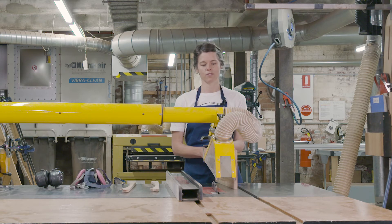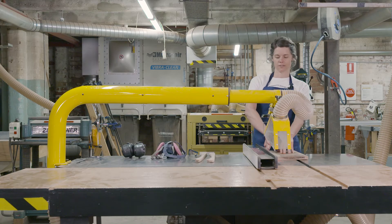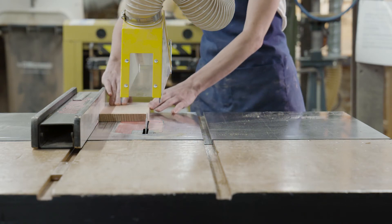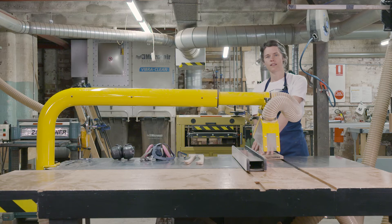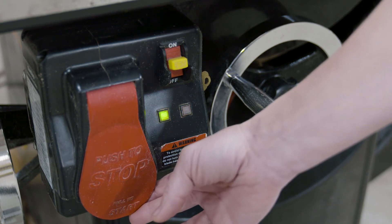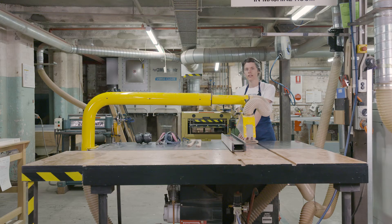Consult your tutor if you're going to make a deep cut. Now that we've covered the setup for making your rip cut, I'll walk you through the motions of making the cut itself. You'll want the face of the board sitting flat against the fence and flat against the table. Remember to stand to the side so that you're not in the line of fire in case of kickback. Before you run your piece through, make sure it's just sitting behind the blade, not touching the blade when you turn the machine on. Turn it on, wait for the solid green light, then pull out the red lever to engage the blade. Remember to maintain pressure downward and against the fence to keep the piece secure as you're making your rip cut.